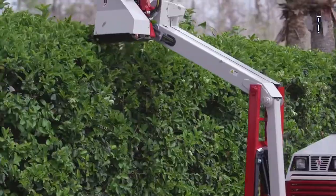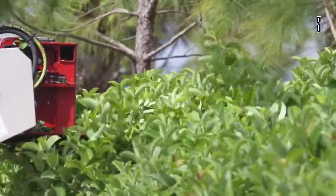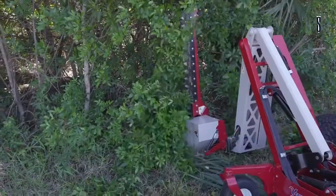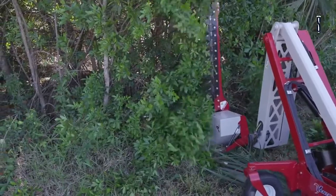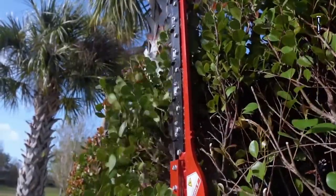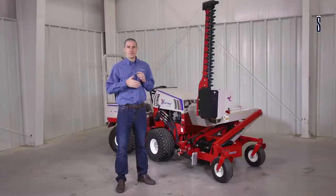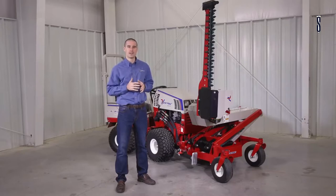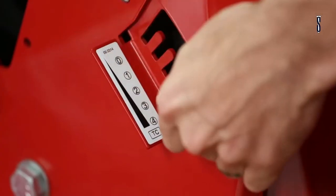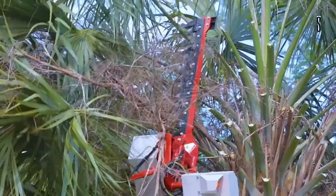The operator has straightforward controls — the mower is operated by a lever in combination with selectable hydraulic circuits, meaning operations can be performed with one hand with a minimum of errors. The machine has a vertical reach from the ground of 142 inches, a horizontal reach of 115 inches from the outside of the single wheels, 103 inches from the outside of the dual wheels, and a maximum top cut from the ground of 82 inches.